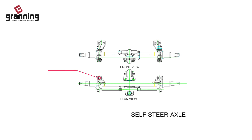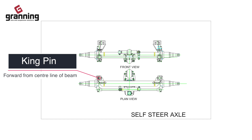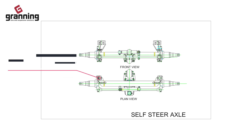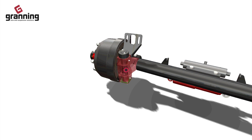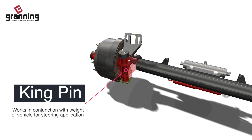There are three main types of steer axles. A self-steer axle is where the position of the kingpin and the weight of the vehicle when cornering causes the axle to steer. When the vehicle goes in a straight line, the self-steer axle follows and centres itself. Self-steer axles have to be locked in reverse.